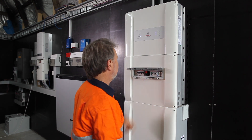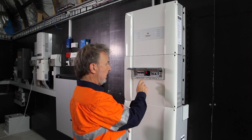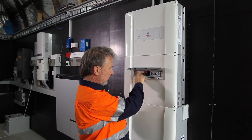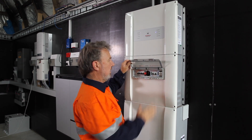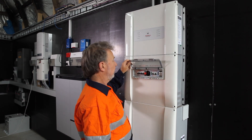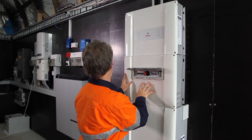So of course I need to switch off all AC circuits and DC circuits to the unit — turning off the AC input, AC output, the battery, and finally the PV input. Wait for it to de-energize so that all the lights have gone off, and also isolate the unit at the main switchboard.